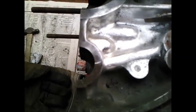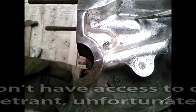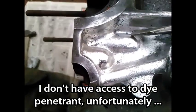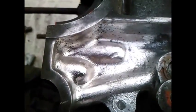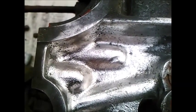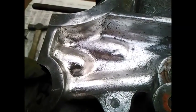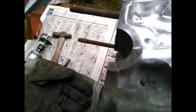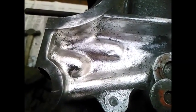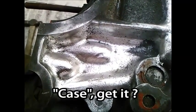I've removed all the epoxy and couldn't help but shine up all the surface with the wire wheel. I don't know if this is a crack here or just a striation in the casting — similarly here. But that's all I found. No gaping crack, certainly. Maybe someone just filled in that area thinking it would make the case stronger, or was afraid these little marks might be cracks. Not an open and shut case — pun intended.